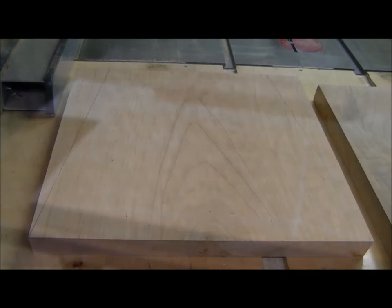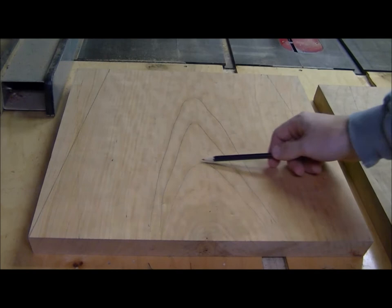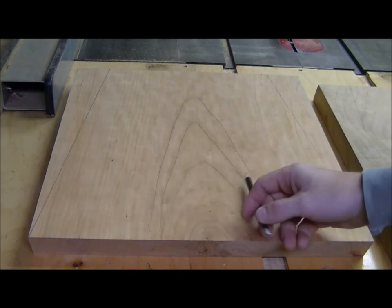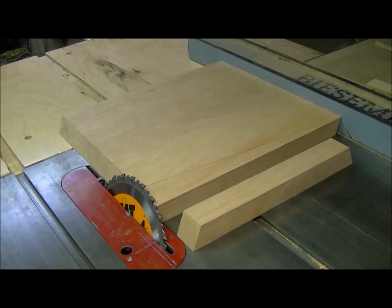Since such a large aspect of this piece is the beauty in the wood itself, we want to make sure we make very conscious decisions regarding how we orient the grain in each of the pieces. Here we have one of the legs and each of the legs exhibits cathedral grain. You can see these pencil lines drawn along the grain — these arcing shapes — and when we cut the taper in this leg, we want to make sure that these cathedrals are pointing upwards.